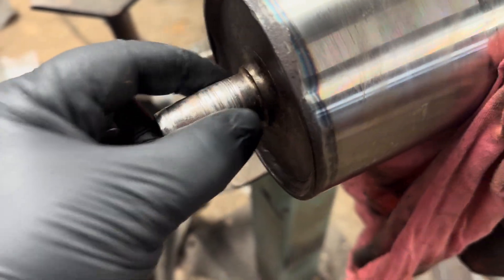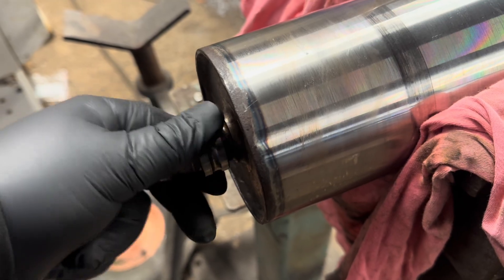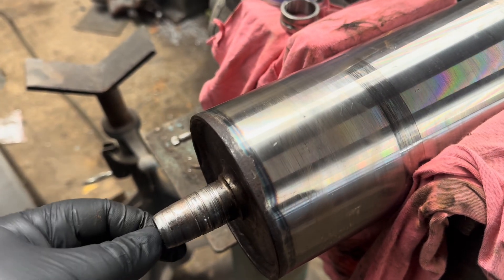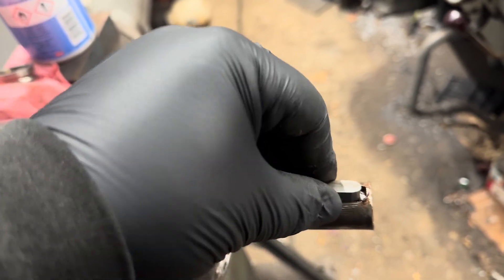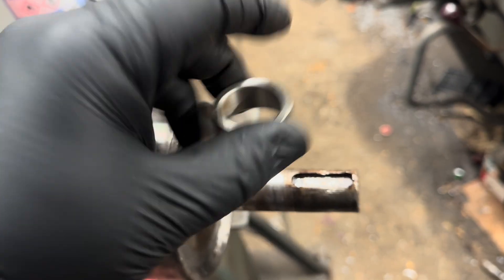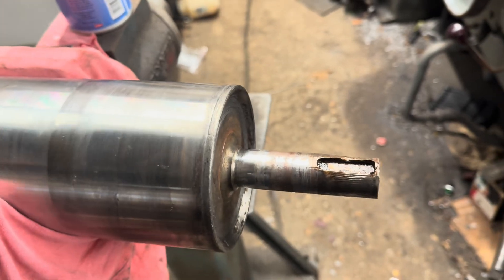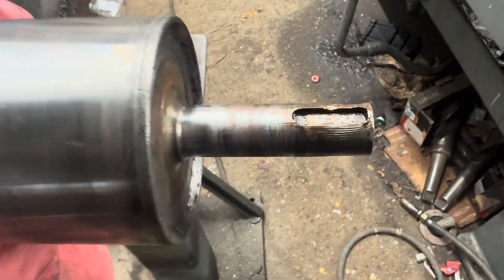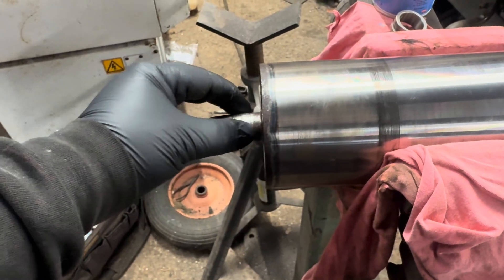Back in the workshop — you can see just how worn that shaft is. This isn't 25mm anymore. Getting a ring up to about there it does go tight, but it's well under size. I can't even get the 25mm ring over where the key was. I don't know how the old bearing came off, but it just slid off — it must have been worn to hell. The damage on this shaft is awful.